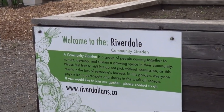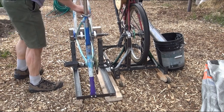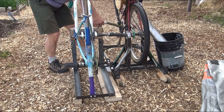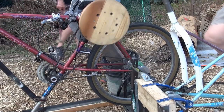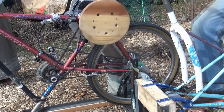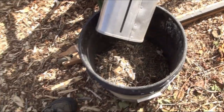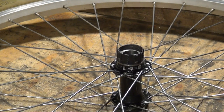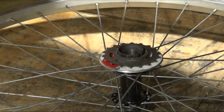This is where the device is going to live when it's ready. It comes together in three steps. This is David, the blacksmith and violin bow maker, pedaling while the machine makes chopping noises. Now Joachim is riding. This is the mulch produced from a sunflower stalk and other things. Last year the mulcher was too easy to spin, so this year I increased the flywheel gearing from a 12-tooth cog to an 18-tooth cog, and added some fences to keep the chain in line.